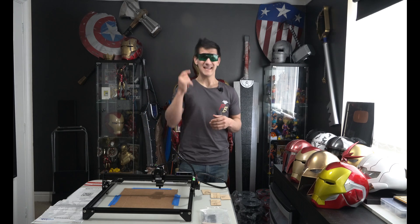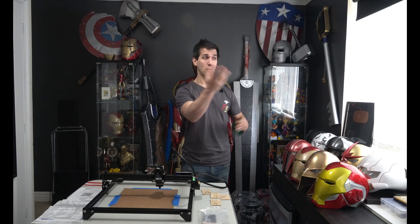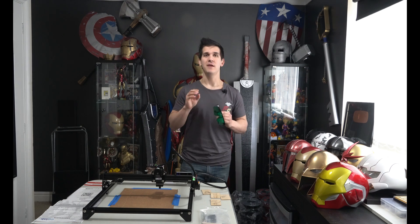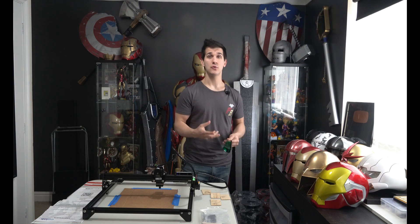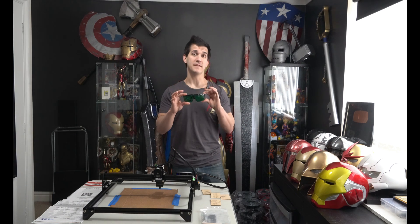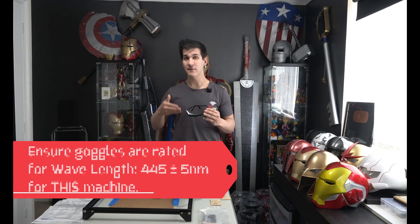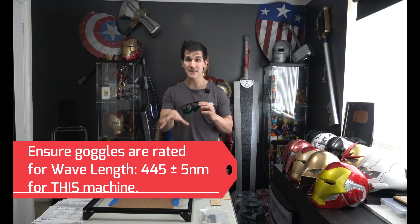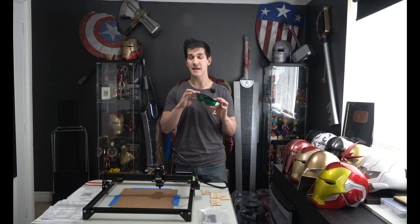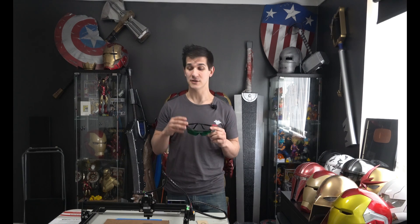The last thing I want to talk about is safety. I did a lot of research on laser safety. I'm no stranger to machinery that can injure and or kill you — I work on jet engines and I've been a mechanic all my life. Things that are dangerous don't scare me, but because I respect them, you need to always stay on your toes. I've worked around lathes and CNC machines — those are terrifying. The probably biggest thing with these is some type of laser safety glasses. I went and ordered an actual legitimate pair that are rated and safe for laser engraving and cutting because there have been reports of knockoff goggles that aren't rated properly for the laser you're using.